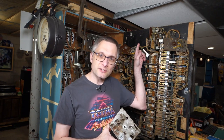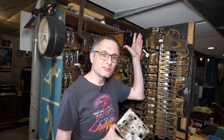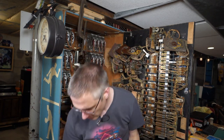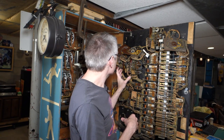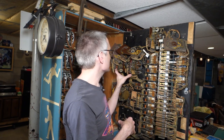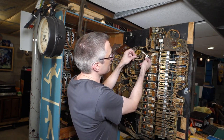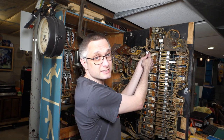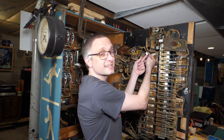The reason I pulled all these other ones off is the way they're situated in here - they're really hard to work on. They're probably one of the first things that were installed on this backboard assembly. Like the spare unit and game selection, I actually had to pull those down and unbolt them just to get at the bottom screw where this switch holds on, because to get enough space to access the other screws, you've got to take this off first.